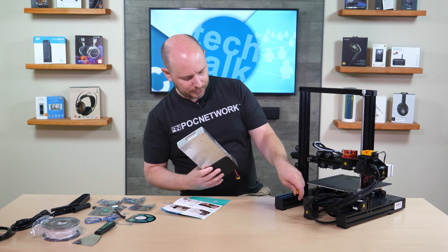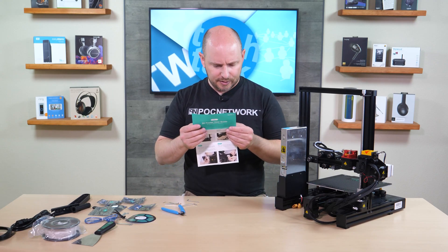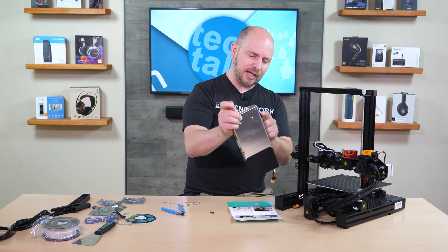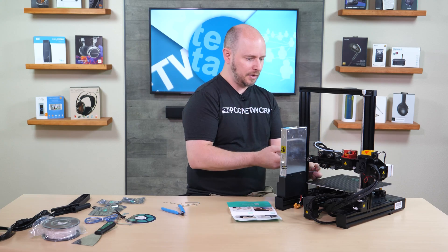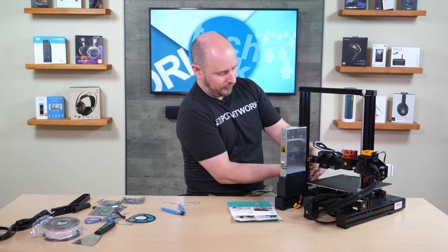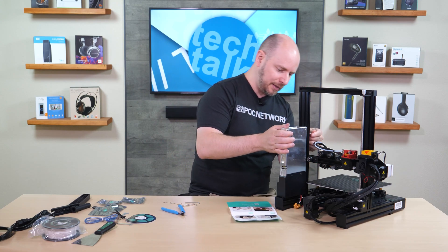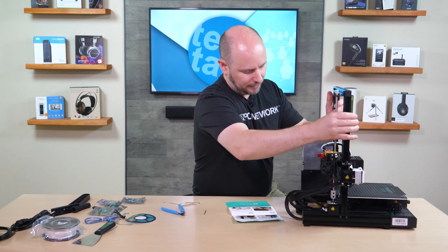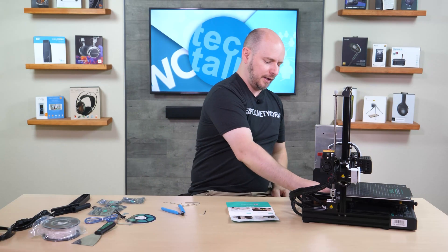Find the Allen key that fits the bolts you're inserting and screw them in. The power supply goes on the back on this side, and the connection it plugs into is right here — this just goes into place there. You can make your connection once it's attached. The accessories in bag two are used for the attachment, and you come to the front side of the printer to attach it at the two hole points. Tighten everything down so it's nice and secure, then connect the two cables which snap together by plugging them into each other.